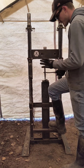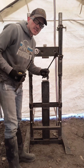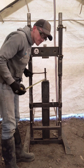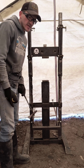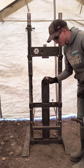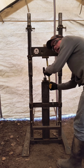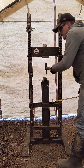Now I'm running into the problem I had with the Clay Spencer hammer. If this is as tall as it goes, that's how much room I have. If I was working on something flat like this spoon — maybe a quarter of an inch thick — I'm looking at like five inches of stroke. And you might be able to get that done. Somebody might look at this design and think it's over-engineered — why not just make that shorter? We could make it shorter. But there will always come a point when you're working on a taller piece. An inch-and-a-half stock is very common for hammers — I'm a toolmaker. This common punch I'd use for a hammer puts us at about four and a half inches, and really it should be longer. So we're looking at closer to four inches of stroke before I actually start punching into it.